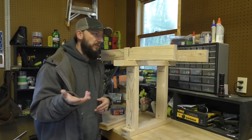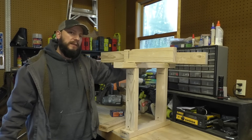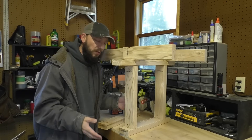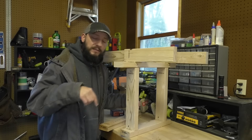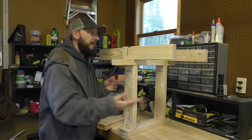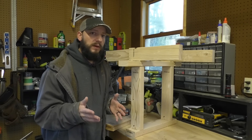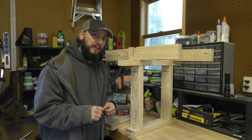Whatever the case, it's very important to support this. If you go and cut these 2x4s — not just for later on making sure you have the proper header, but while you're doing the job — this could obviously sag, or worst case scenario, it could collapse. So while you're doing this project, the first thing you could do is build a temporary wall on each side, cut these out, put the header in, and support it properly. You may even need to go all the way down to the basement, depending on the size of the opening, and potentially do a footer. In my case, I'm doing a very small door opening. And if you're not sure how to identify a load-bearing wall, I actually made a video about it and I'll leave a link in the description.